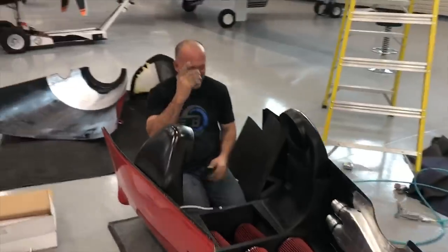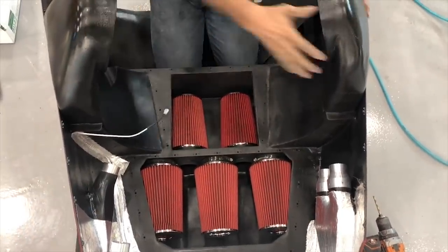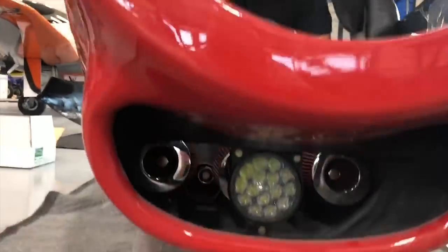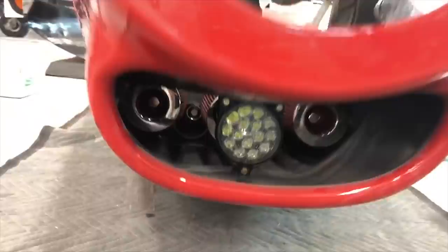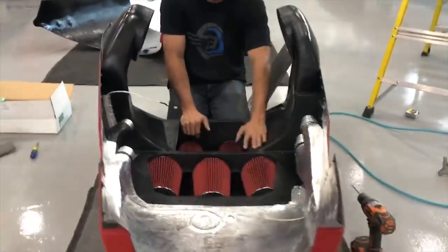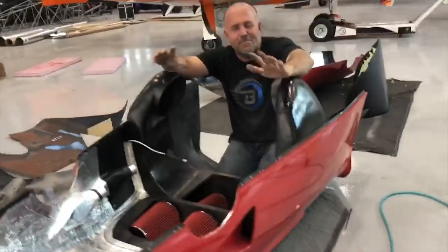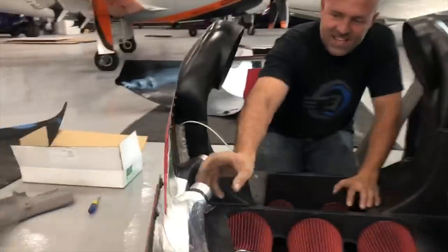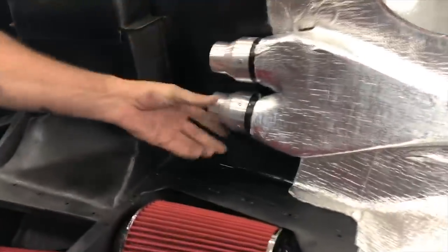That's it — I got all the filters in. Five filters. Here's the intake — they snap on, goes into the turbine. I'll close out the filters. I've got a landing light inside the nose here, more of a recognition light. And I've got my heat shield on around the hot section of the aircraft. I've made my own little aluminum rings for where the hoses go on. The little scat tubes are always a pain to get onto different fittings, especially carbon fiber ones. So I made these just a few thousandths smaller and the hose just slides on perfect — it's a lot easier to get this cowling on and off.